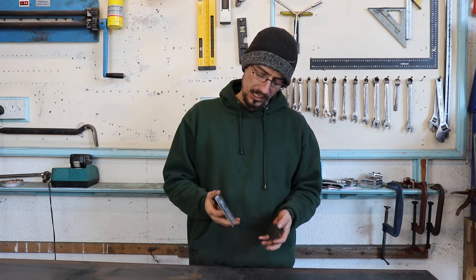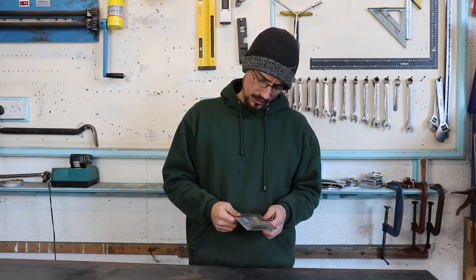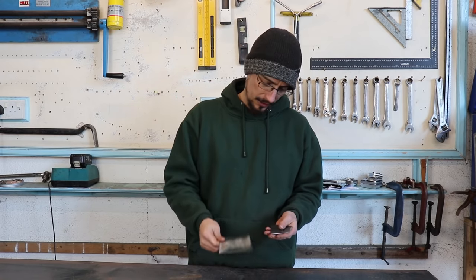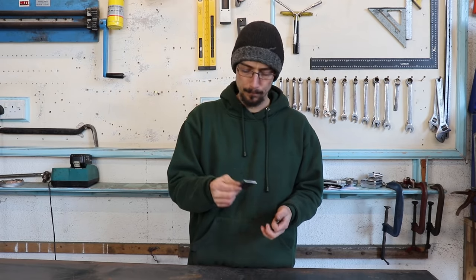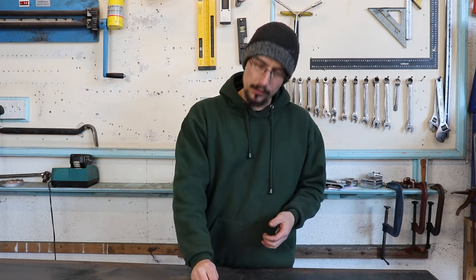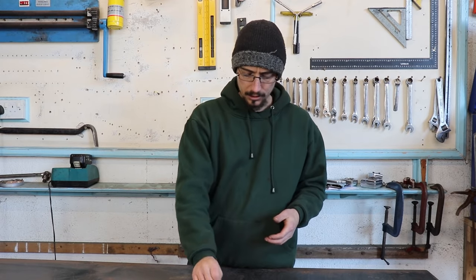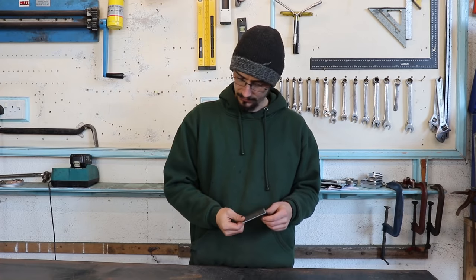For me it's mainly like roll cage feet. This is one mil, which is going to be like what your floor pans and all your panels are made of — sometimes thinner than that, but that's one mil. And then three mil is what I have to make my foot plates out of, so that's normally what I'm doing: welding three mil to one mil. And I've got a bit of four mil as well. It's good to know how to do it for anything, really, like exhaust brackets or anything like that.